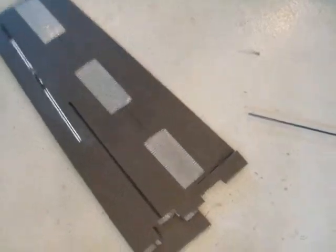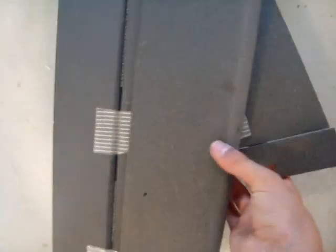At this point, the wings are as finished as we can get them. This wing has both slots cut, one carbon tube installed, and the KFM airfoil installed on the bottom. This wing has both the airfoil pieces installed, so it's three layers thick. And then it also has the big spar installed there. Now, once you get those done, you can move on to the fuselage again.